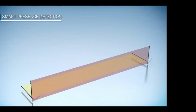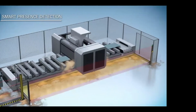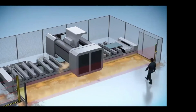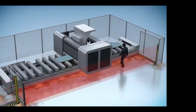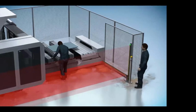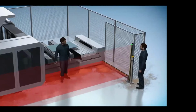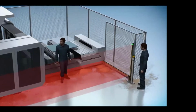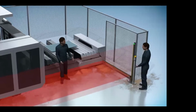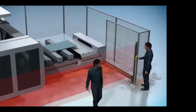In applications where you use the vertical orientation of the light curtains, we also put a horizontal orientation and bring them in cascade. What is the reason? In the case where the operator broke the vertical plane, if the horizontal plane wasn't there, the operator on the other side you see here could reset and start the machine up, and we'd have an issue. But because we did this cascade, this operator has to let that clear out before he can clear the safety.